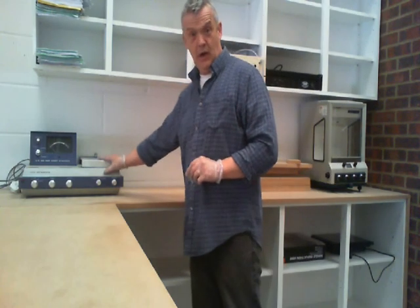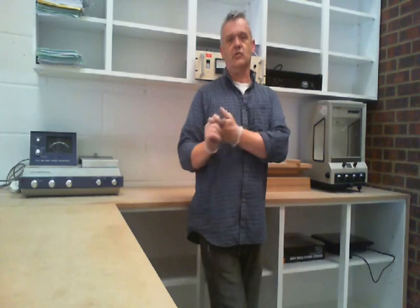What you can see here is a spectrometer — an ultraviolet spectrometer for measuring the thickness of thin films. We're obviously looking at solar cells. When I produce my solar cell sheet, I need to know the conductivity, which is just the reverse of the resistance, so that's relatively easy to measure using the four-point probe method or my square resistor measurements method. But I also need to know the transmittance — how much light is actually getting through — and this spectrometer will measure that for me. When I'm producing my films for solar cells, which is coming up quite soon, this is an essential piece of kit and a key metric.